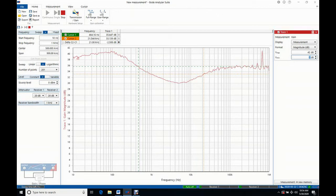Then it goes back up. This is the amount of attenuation you see from the input to your output voltage — this is your power supply rejection ratio. Another name for this is audio susceptibility, and that's one of the common measurements done during testing. This is the way you do the audio susceptibility or the power supply rejection ratio. Thank you.